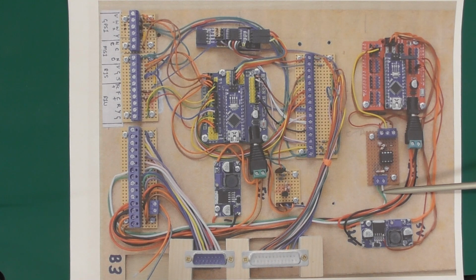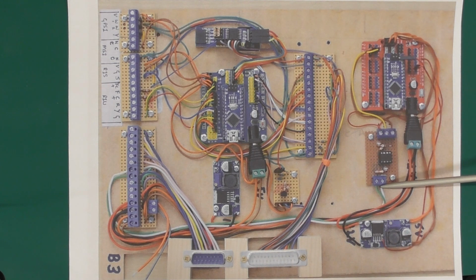It goes to quite a few of them, and it goes to quite a lot of Merg accessory decoders, which are already on the old part of the layout. But what we have here is an Arduino sitting on a breakout board, which, with the software in it, can control up to 12 servos from DCC commands. The DCC commands come in via this accessory bus, and this is an interface that takes the high track voltage that swings backwards and forwards between plus 12, minus 12, minus 12, plus 12, and turns it into a 5-volt logic signal here. Have a quick closer look at that.